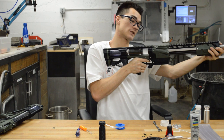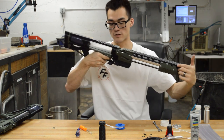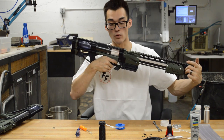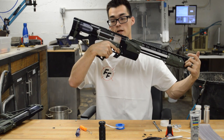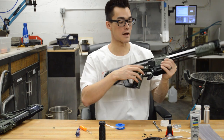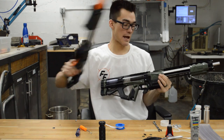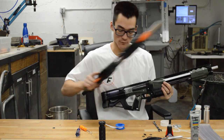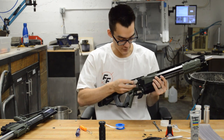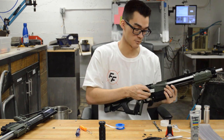That's much better with the machine plunger — it's still leaking slightly from somewhere in the base. I did not lubricate the ram core O-ring, so that's probably where it's leaky, but that's a lot better. The fault was mostly in the plunger. Also, if you notice that your nylon coupler has broken, you can replace it or add aluminum inserts that reinforce the coupler, making it pretty much indestructible. You just insert the aluminum reinforcement inside where the pin goes in, so it's much stronger.